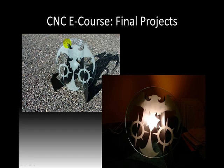And kind of one of the reasons I'm pointing this out is I also have a vinyl cutter. And if you have a vinyl cutter, you can cut out sandblast resist in various shapes and sizes. It's a type of CNC, to me anyway. Crosses over nicely. And so I cut out that vinyl sandblast resist. I adhered it to this glass disc and then sandblasted out this design. But this is actually a floor lamp, and it has a foot switch. This is it setting there, and here it is illuminated. You just throw it into a corner, and as you walk by, there's a foot switch you can just step on to turn on the light down in that corner.